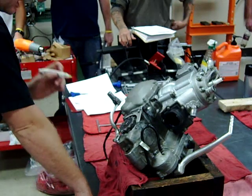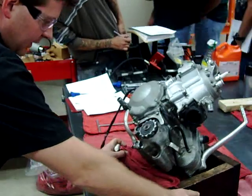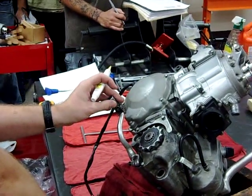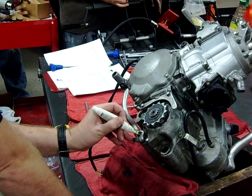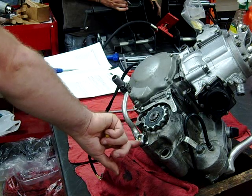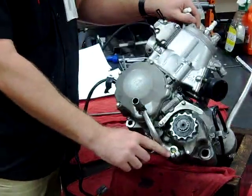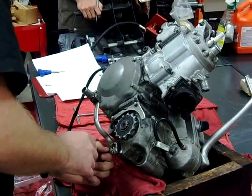Some of you have heard this tip before: on the open gap of the shifter — you might want to come around and look at it — the last person that had this bike liked where the shift lever was, because they're not complaining about it to you. So what I'm going to do is draw a line right across that shift shaft that represents the split on the shifter. Now I don't have to think too hard when I go back together.